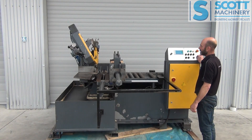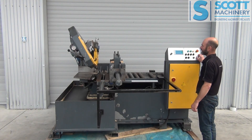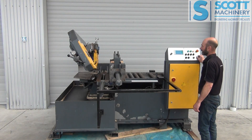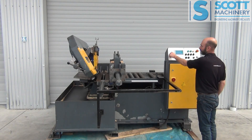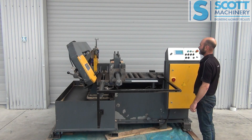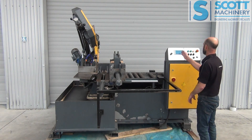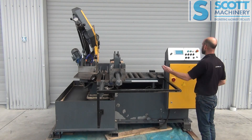That's running at about medium blade speed — I'll slow it down then speed it up. So that's slowed down, half speed, full speed there. I've sped up the descent a little bit. I've just got it cutting a bit of wood. So that's its manual operation. When you move the shuttle vice you've got a wee digital display here showing your measurement.